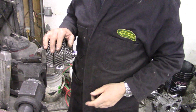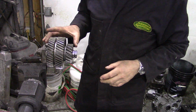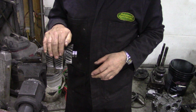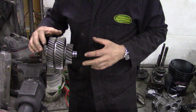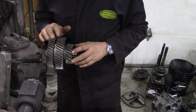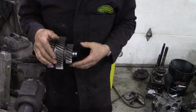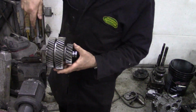Last week I got a message from Simon, who's a new subscriber, and he wanted to know how I made the tool to set up this intermediary gear. It was really easy because you don't need that much skill. To put a solid bush in here, you need a little setup like this to calculate the end float, because you don't want much, but you don't want it too tight. And this gets away from using the crush sleeve, which doesn't crush the bearings properly. It crushes them all cockeyed, and that's why they start to rattle around. So let me take this one apart and I'll show you how easy it was to make.